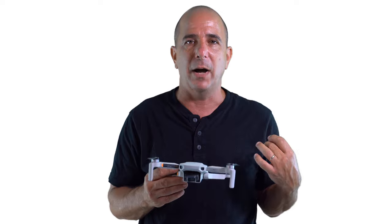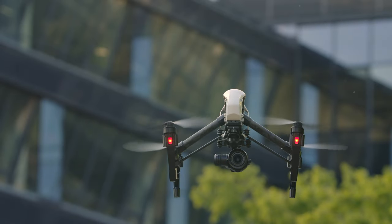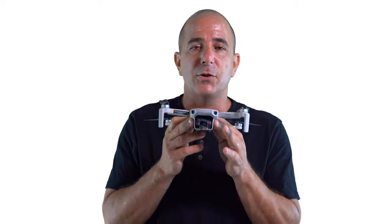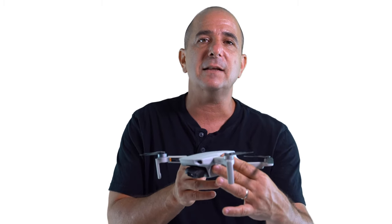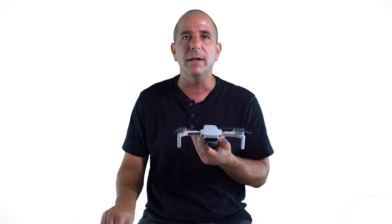Maybe a few hours forward or a few seconds backwards — it doesn't really matter. The fact that a gyro drifts is extremely important to keep in mind, because the longer I wait — same as with the clock — the more drift I have. A camera using the gyro and tiny motors can stabilize itself very well in the short term, but after a long period of time, a drone using only a gyro would drift in exactly the same manner that a clock would drift. Those drifts are here to stay as long as you are using only gyros. To fix that drift, we need a global sensor or another sensor that has no drift property.